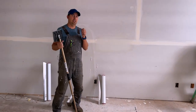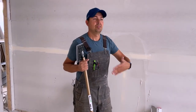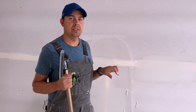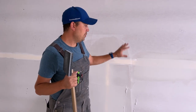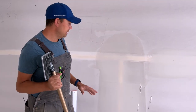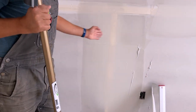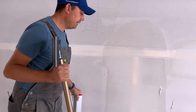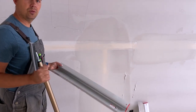Final notes: less mud. You can do multiple passes — you can go back multiple times. You don't have to just do the two coats; you could do three or four coats. Just keep working it until you get used to the feel of it. Don't try and load too much mud on at once — just a nice clean pass, keep it thin and you'll be okay. On your butt joints — your vertical butt joints — you want to go at least 12 inches on either side, minimum. That's where something like this 32-inch blade is really, really handy. You can get even bigger ones — I have a four-foot one as well.